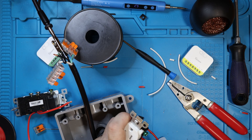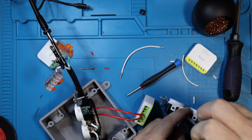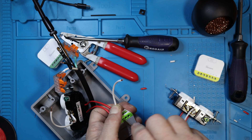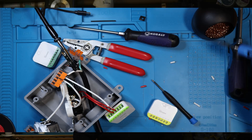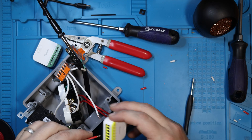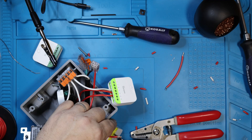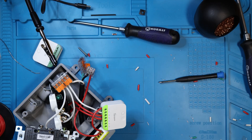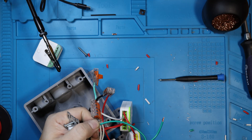I re-bridged the neutrals on the outlet because I was much dumber a few moments ago. After cutting and trimming the wire to go from the outlet to the neutral Wago, the camera stopped recording and I didn't notice right away. By the time I got back up and running I had already tinned the neutral, so I ran the neutral on the other outlet where I hadn't removed the neutral side bridge. Then I gave the mini relay that needs one a neutral of its own. I clicked all the neutrals into the designated Wago, then pulled the one for the relay and tinned it along with the hot wires. I connected the second outlet's hot wires to the other mini relay that does require the neutral. Then I ran a wire from the hot on the cord to an L terminal on the first relay, and from another L terminal on the first relay to an L terminal on the second relay. Next, I cut, trimmed, tinned, and attached ground wires to the outlets and the Wago connected to the ground on the cord.